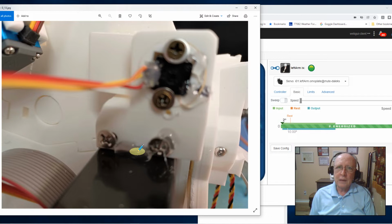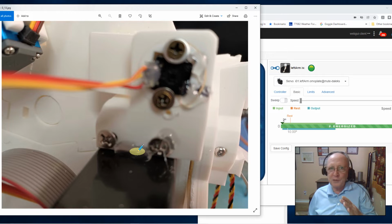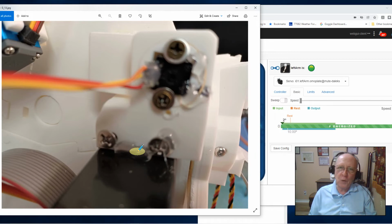A 120-foot cable that's $10 a foot is a lot of wasted money. So we always used the standard. You measured it to fit and you added 5 to 10 feet to the length, depending on the difficulty. It was a lot cheaper to throw away 3 feet because your measurement was off by 2 feet than it was to throw away 120 feet. So I'm sure that's where all my worries come from. But for my own comfort level from now on, I'm going to use extra long cables just so I'm comfortable. Enough said on that.